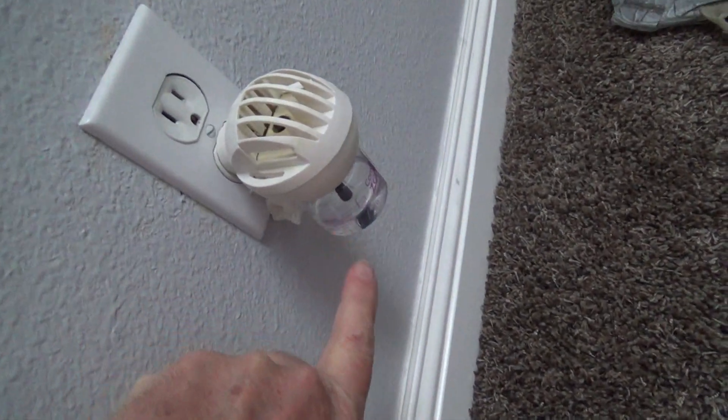Lots of times on your different plugs inside your bedrooms, you're going to plug in a vacuum, a lamp by your bed, or your charger for your phone. And so lots of times you're not going to overload a circuit. You don't want to overload a 15 amp circuit with too much power because then it could trip your breaker — or your breaker may not trip and your wire could fry up in your wall or something could spark right at your electrical outlet.